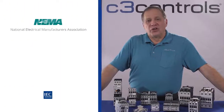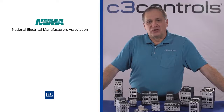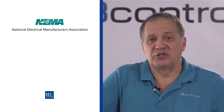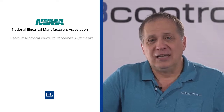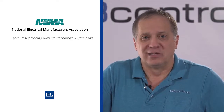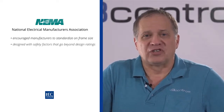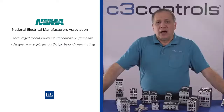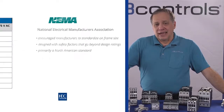NEMA, or the National Electrical Manufacturers Association, is the largest trade association of electrical equipment manufacturers in the United States. NEMA encouraged manufacturers to standardize on frame sizes to allow users to confidently specify, purchase, and install electrical components from different manufacturers without a lot of hassle and cross-referencing. NEMA contactors are also designed with safety factors that go beyond design ratings, meaning oversized, up to as much as 25%. NEMA is primarily a North American standard.